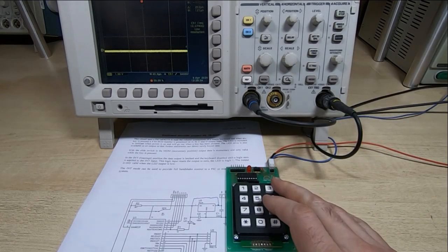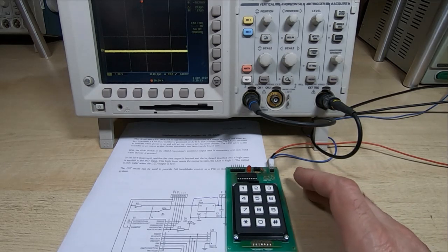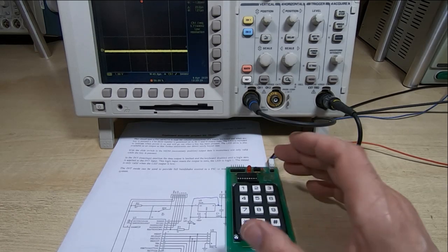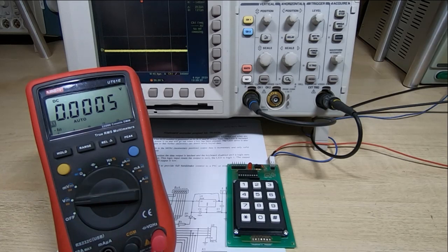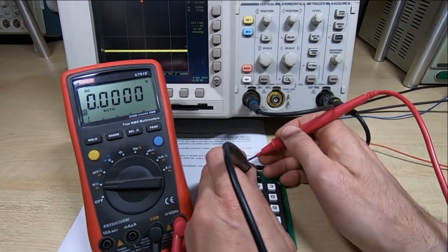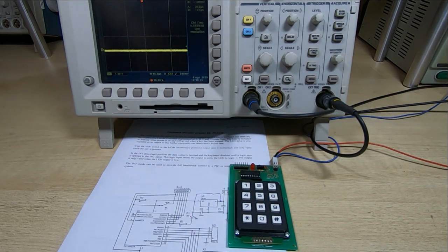I've got it hooked up to the bench power supply, fitted the LED, done a visual inspection, and checked all the connections — it looks fine, he's done a good job assembling it. I don't think it's an assembly issue. Supply is set to five volts — this is an older PIC so it works on five volts. It's drawing two milliamps, so it's not obviously doing very much. We'll bring in the test meter to check the supplies — we want to see if we're getting power to the PIC. That's pin 5 for ground and pin 14 for power, and we're getting five volts as expected.